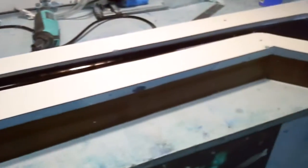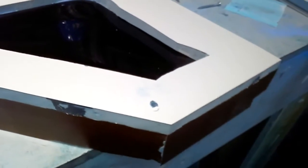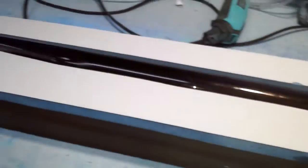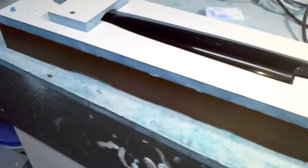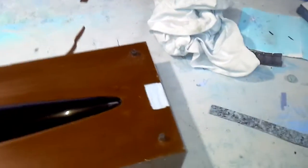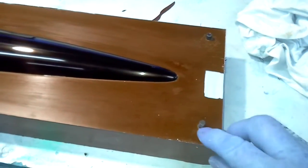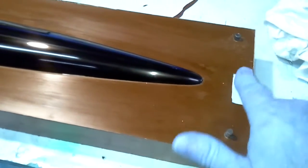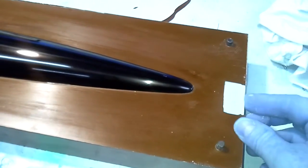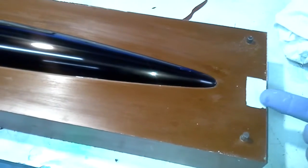I've just pulled the sides off, and I've just got to take this top parting plane off now, and then we'll start waxing again. Well, all the MDF has been taken off now. You can still see my locating pins, a block of balsa. So when I come to open or part the next plane, I'll be able to put a screwdriver in there and then pop the mould.